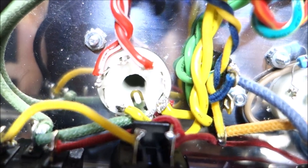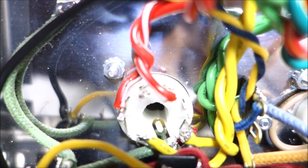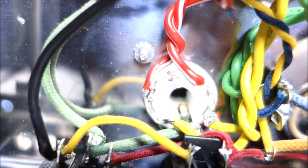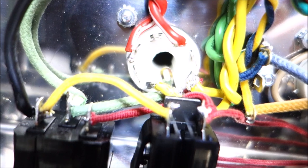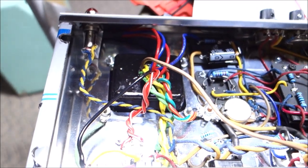and the high voltage comes off of 8, and then that goes to the standby switch, which is all the way over there. So this lead right there is the same lead that you see soldered onto the yellow one there. I bent that one pin down, that's an unused pin, just so it's out of the way, so it doesn't touch the earth ground of that socket. So at this point, we're ready to kick some tires and light some fires, I suppose.